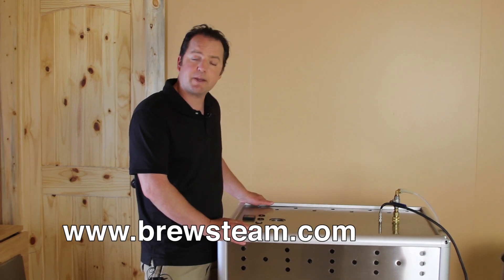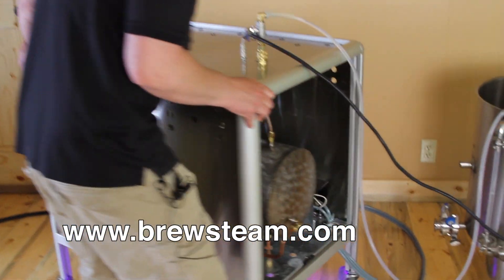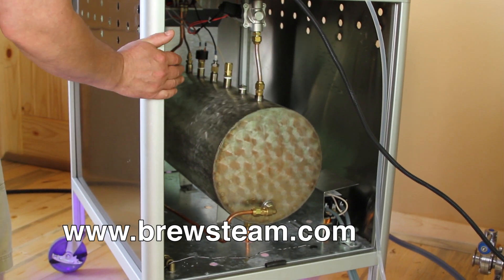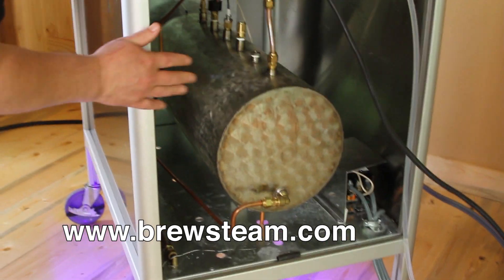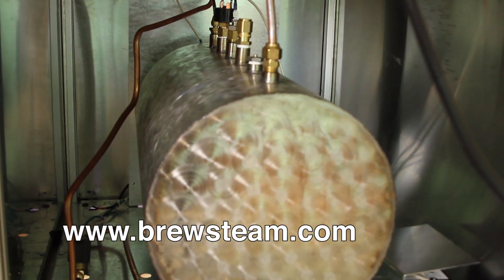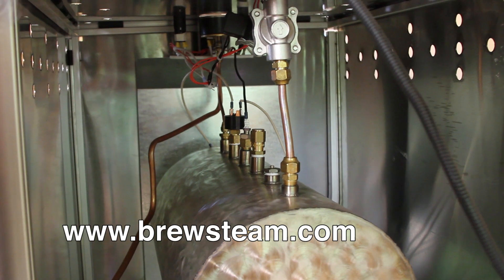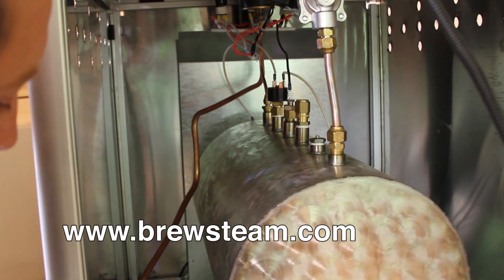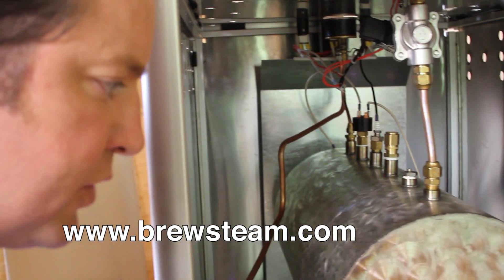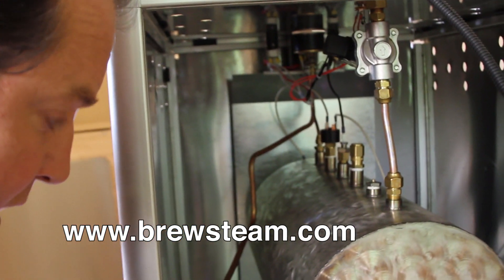It's very easy to take apart. The beautiful part is on the inside, which is hidden. We've got 304 grade, eighth-inch thick plate stainless — very, very heavy duty. Of course, polished. We use a TIG welder to weld the whole thing, so the welds are just superb. Inside here, we've got a very heavy duty 65-amp contactor. We've got our heavy duty solenoid system, all stainless, and that turns your steam on and off. We've got the PID controller, and of course all the wiring is protected. This unit is not at all built with a short term in mind — it is designed to be used for many, many hours and many days of continued use without breakdown.